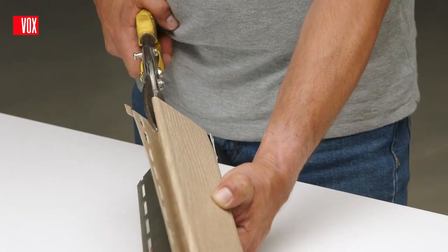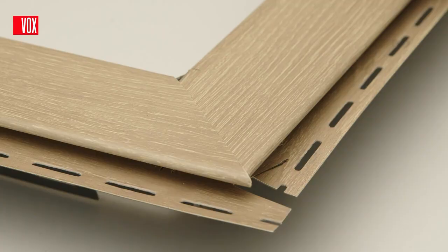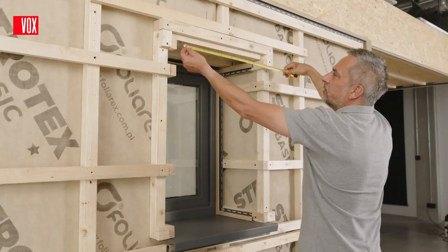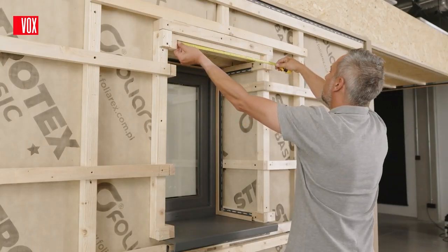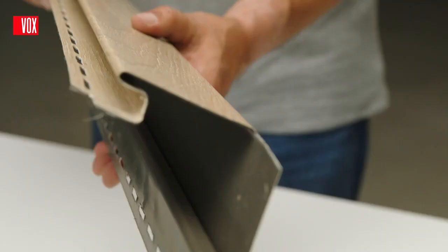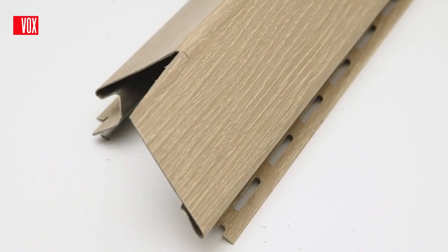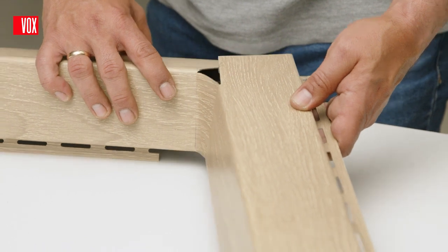The outer corner sections need to be prepared so that water can flow into the drainage channels. For this, you first need to get the dimensions. In the case of the internal dimension, 1 centimeter must be added on each side for the overlap. This is what correctly cut corners should look like. They are connected in such a way that water can drain away from the facade.